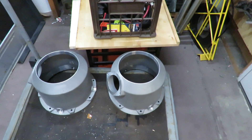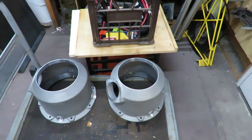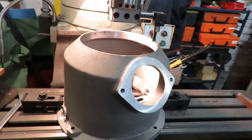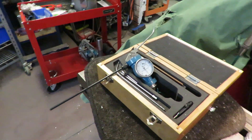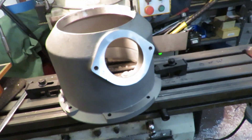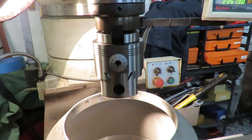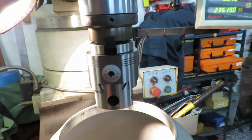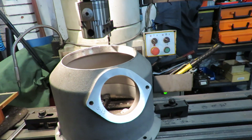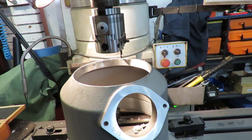What we have here is some castings that have come in and the upper bore is undersized, so we've set up and machined these two out and we're just about to do the third, the last one. That's set up, centred up. We've used the centre finder. We've got it all set up locked into place. We've got the boring head set. We've set it — now it's on five, we're going to go up to 15, so there's two passes. We've actually got to take out about one and a half tenths of a millimetre.